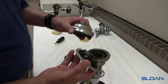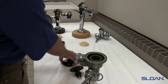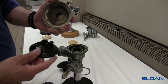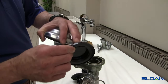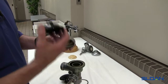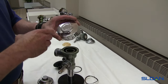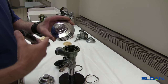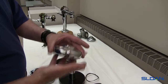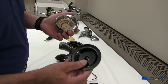One of the things on this older valve that was not correct, besides the pipe dope, is the wrong inner cover. The old-style inner covers have a very long nipple on top that bottoms out against the inside of the cover, and is secured at two points. The thickness of this plastic mimics the old design of the brass inner covers. The A11 was designed for these older bell-shaped covers. The A71 inside cover was designed for the current cover — and it may be stamped Royal, Regal, or you may see the word Sloan or Royal II. All these types use the A71.